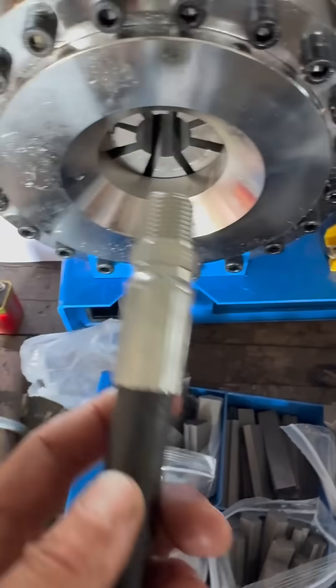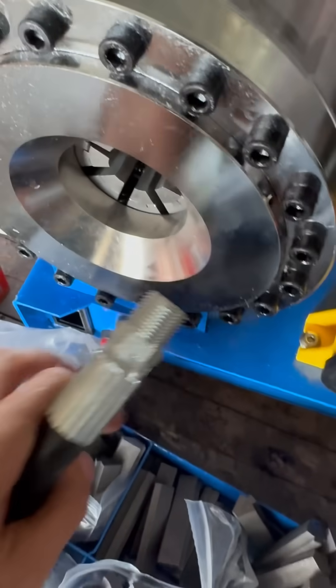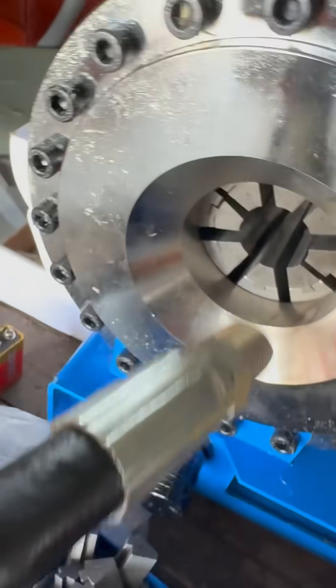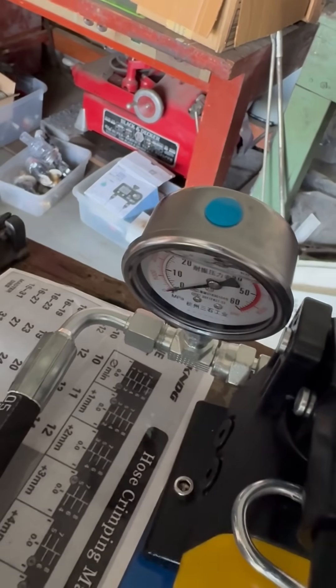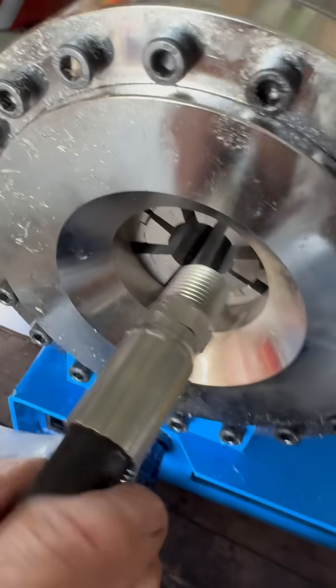I stick it in from here now and it comes out just beautiful. I didn't use all this fancy stuff — I just wait until I see that the dies are about the thickness of this metal off the hose and then I stop. It's almost at around 4,000 PSI on that gauge, and it's that simple. None of these charts seem to make any sense to me.